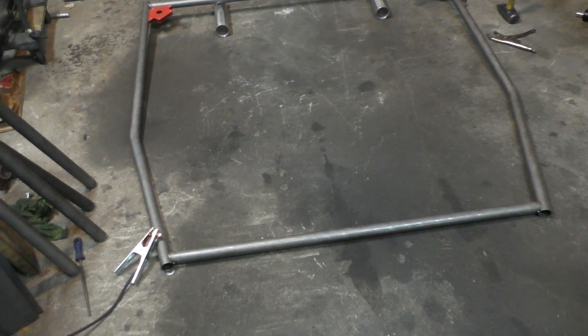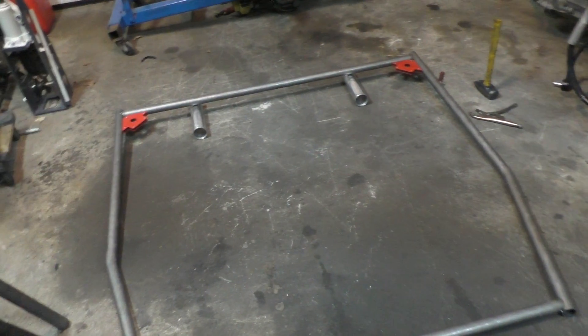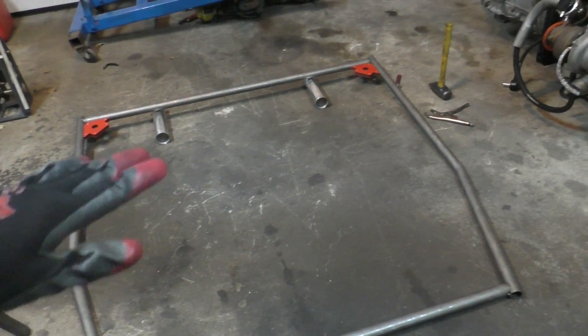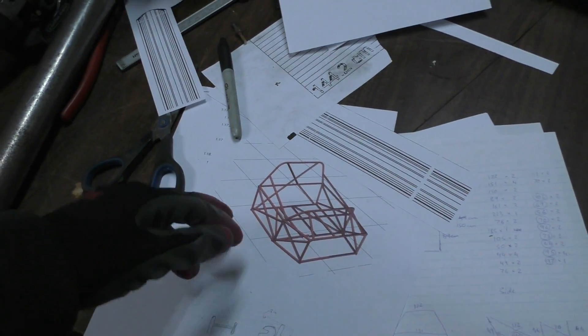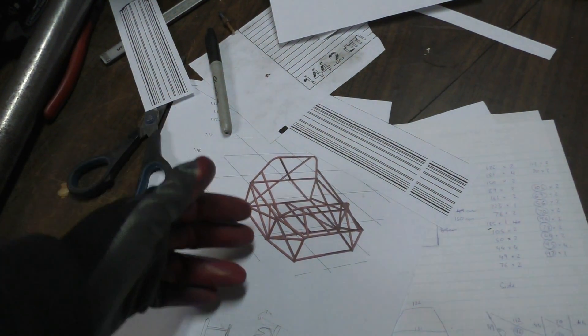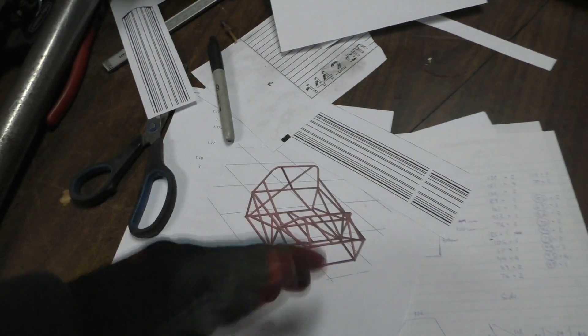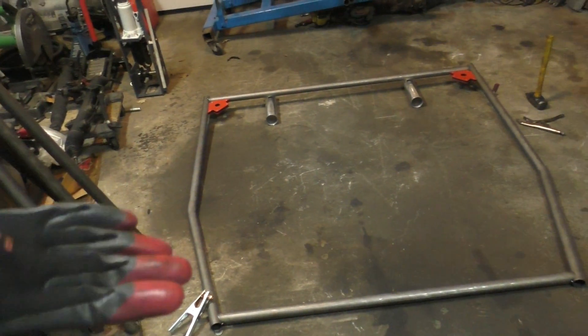I'm not using a jig, and my concrete floor isn't perfectly level either, so I've put washers and tubes at the back and measured everything out so it's extremely level. The tricky part is that this section of the frame isn't even perfectly flat underneath — it's slightly curved to compensate for a bigger diffuser. I did some CFD analysis and found that if the diffuser starts around the center of the car the ground effect works best and airflow stays attached, so the floor slopes slightly.